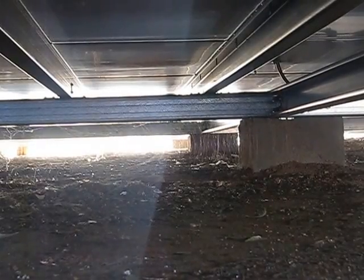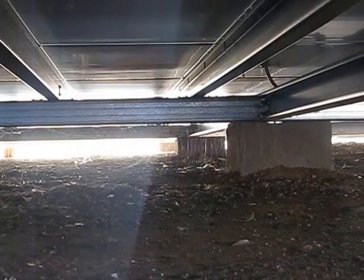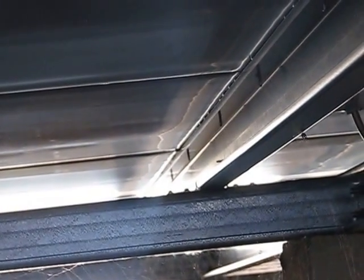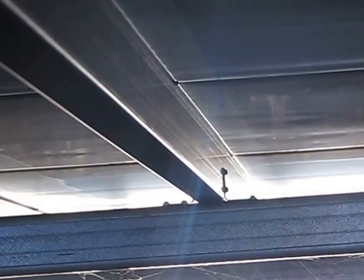On top of those steels that sit on the blocks, and they're C-channel steels, commonly called a purlin, C-channel, purlin, whatever you like to call it. They're relatively light gauge. They're what you see in factory roofs and sheds. A lot of sheds actually use a lot of C-channel. And on top of that is another C-channel, that one up there. Same sort of deal. They're just the same as what you would call a floor joist, in the same sort of pattern, 400 centers across the build. And that's pretty much what holds this place up.